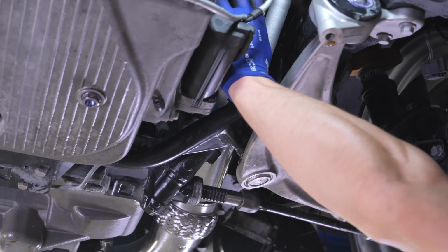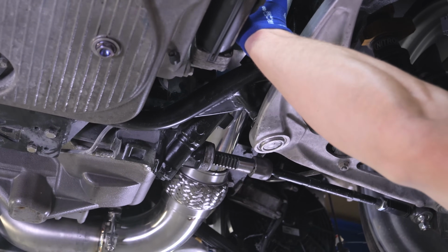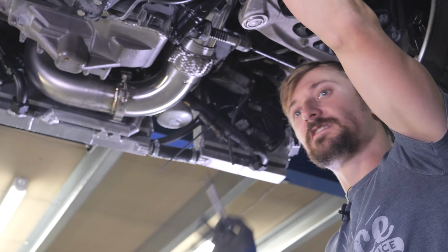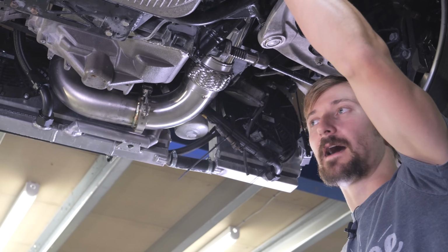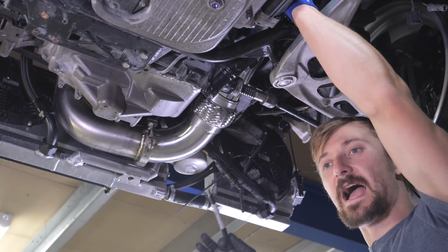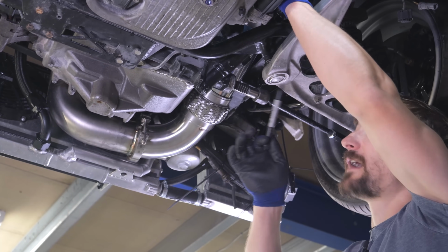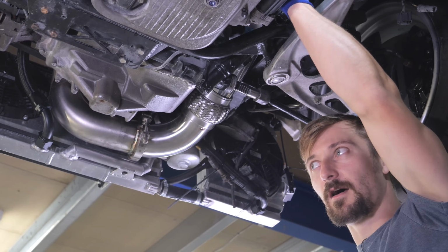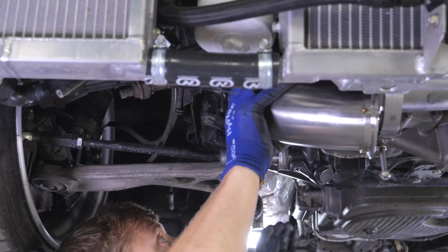If it looks good, then what I'm going to do is prep up these pieces and tack it together. So once that's tacked up and I'm happy with it, I'll actually weld that, because every time you weld, there will be a small amount of movement compared to where it's tacked at. And given some of the tolerances are quite tight, we don't want to go too far on just tacks, because then when you weld it all up, it moves and it no longer fits. So I'll cut that 100mm piece, try it in. If it looks good, we'll tack it all together, try it back on the car, weld it. Hopefully it's all still good, and then we can carry on down the rest of the tunnel.